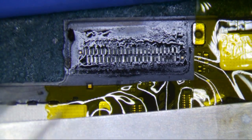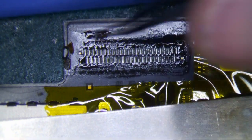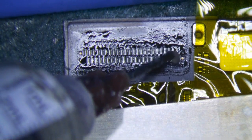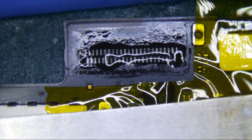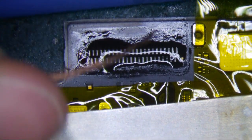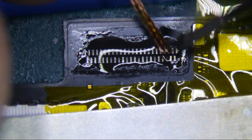The next thing I'm going to do is clean it up with some isopropyl alcohol — 99% isopropyl alcohol. You can use 91%, but understand that the remainder is essentially distilled water. 99% will pretty much dry up completely. Put a little flux on it, then get some solder wick and wick away the tin bismuth and lead-free mix.